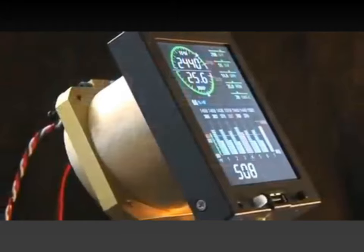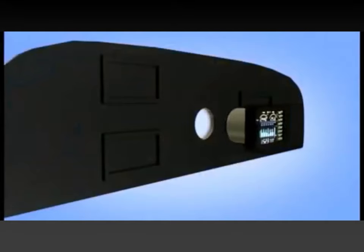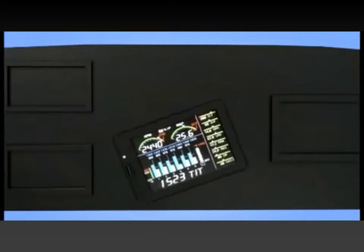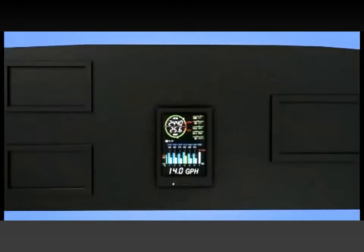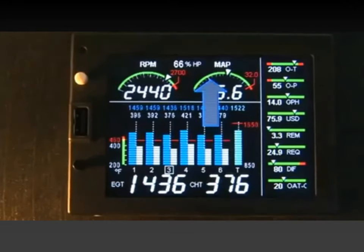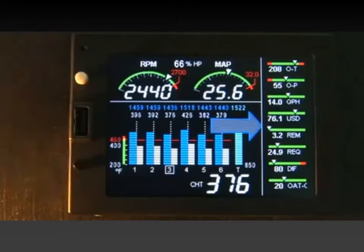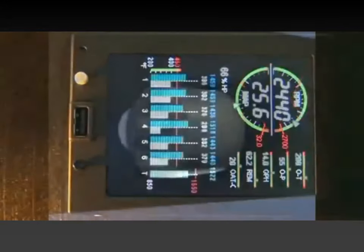The flexible screen display allows the new EDM 730 to fit in almost any aircraft panel. The 730 body is offset and can rotate to portrait and landscape views four different ways to accommodate the most tight-fitting panels. Change the orientation of the 730 display by holding down the white step button until you see an arrow. Tapping the black lean find button will turn the display.